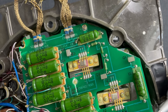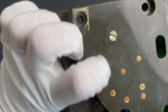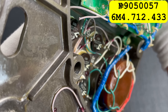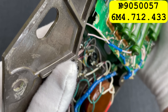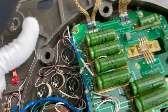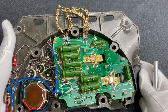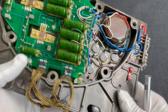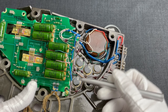Moving to this component — it has a damaged screw, because someone likely tried to remove it, but this also helps us see the protective coating. From the internal side, it has this marking on it: N905576M4712433. Although we were unable to find the exact same component, based on its shape and connections, this is almost certainly some sort of toroidal encapsulated transformer. So the voltage comes in, it converts it to different voltages, and sends it to those diodes here.